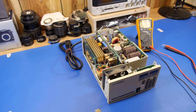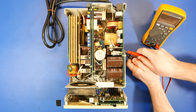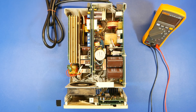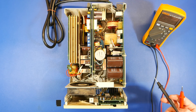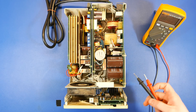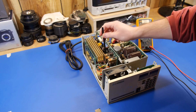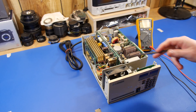Before going further with the teardown, let's check the voltage on these caps. These are quite large capacitors, and if they're not drained, you could definitely get hurt. Capacitors are at zero right now — this has been unplugged for quite a number of hours. I noticed that these bleed resistors are valued appropriately to these capacitors; just after taking the case off while running, it didn't take even three minutes to fully drain them. There are also some brown box components here that I'm not certain of yet — I'm hoping they're not potted components.